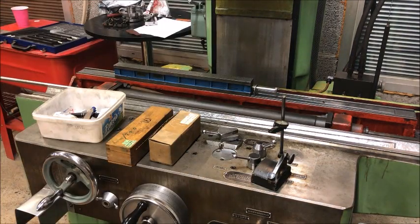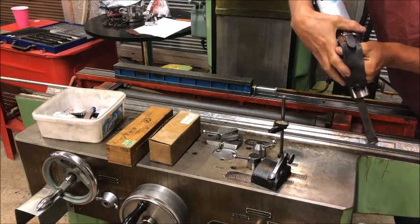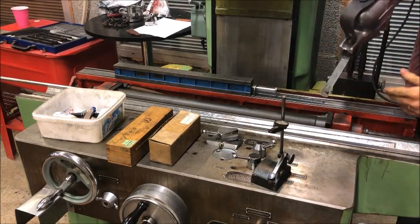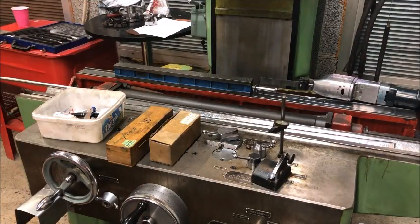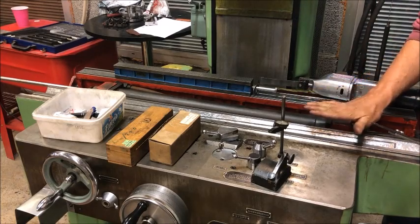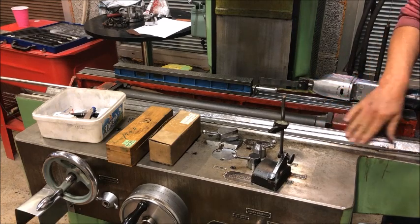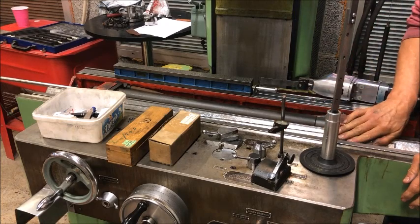However, because of constraints on how to scrape, it was hard to get comfortably down here, because this kept getting in the way. So even though I could work it, I ended up with hand scraping more or less - which was pretty much the easier solution. Therefore, keeping the ratio 1 to 1.4 down and taking that into account, this was more or less power scraped for some part, and by luck and also by ingenuity, we managed.